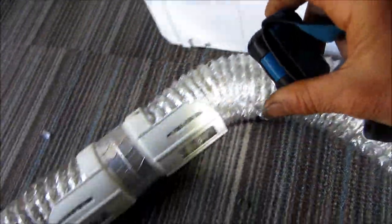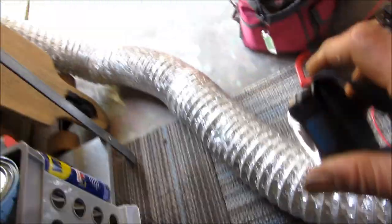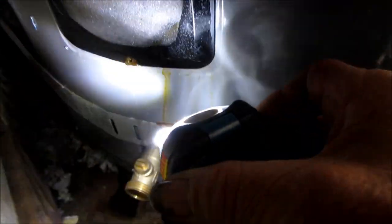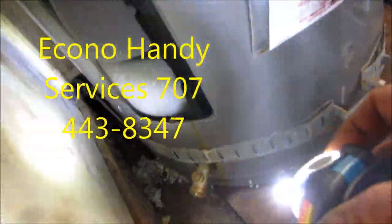The tank will rust if the anode is bad. Let's take a look at this bottom one, just for the heck of it. We got our little friendly creeper hole right there. And we do have signs of creepers here. That's the bottom one — this pad is saturated. You can see the water. Gonna rust on that screw hole. The power may be coming through that pad when it's wet like that.